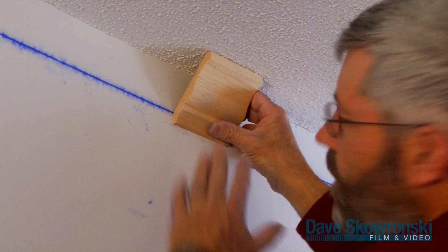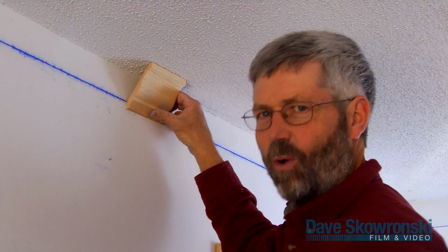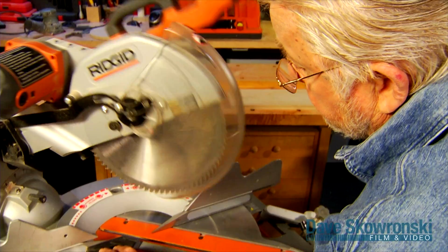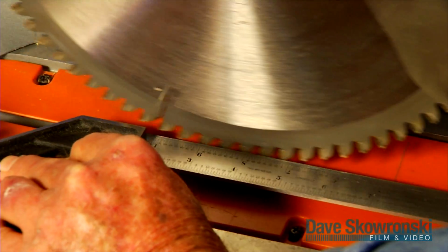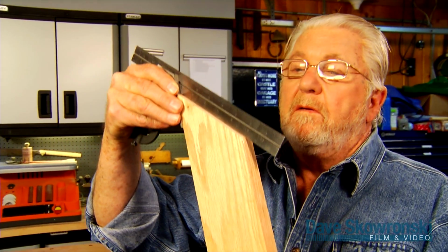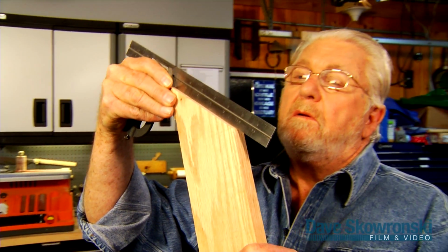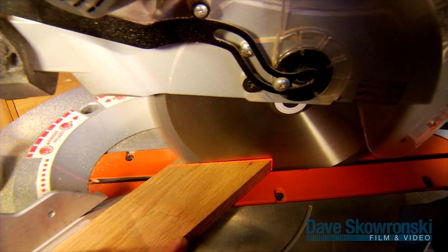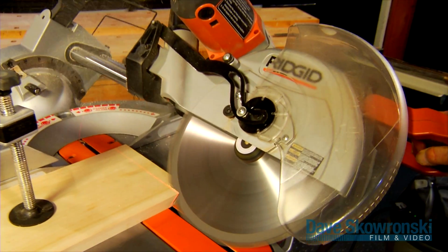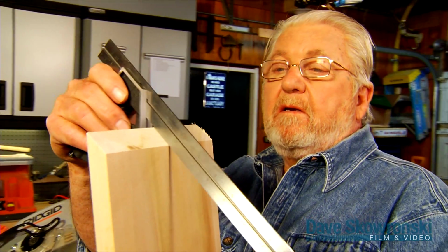That right there is about the way that the crown fits flat against the wall, which is where you really want to install it. The same is true for a 45-degree miter, one of the most common angles cut on this saw. The miter side of the combination square head is a precise gauge for checking accuracy of this angle, which is critically important in making frames and cabinets. Bevel cuts on the power miter saw can also be checked using the combination square.